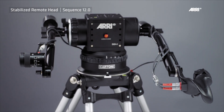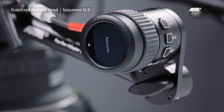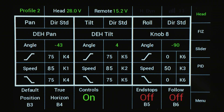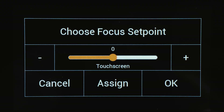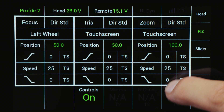The master grip and the OCU-1 will interact via the DH1 and the remote control in the so-called remote mode. The display of the master grip and the OCU-1 will show 'Remote' as soon as the LVAS controllers are connected to the remote control via the DH1. Note: if 'Remote' is not shown in the display, the software of the LVAS controller is out of date and needs to be updated before use. Selecting the marker area will open a new submenu where the desired controllers can be selected and assigned. Select the desired LVAS controllers and press Assign. For more details, please refer to the DH1 manual.